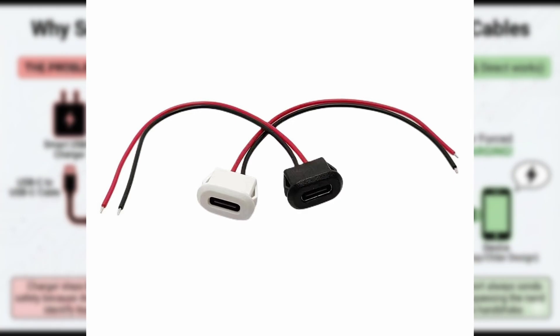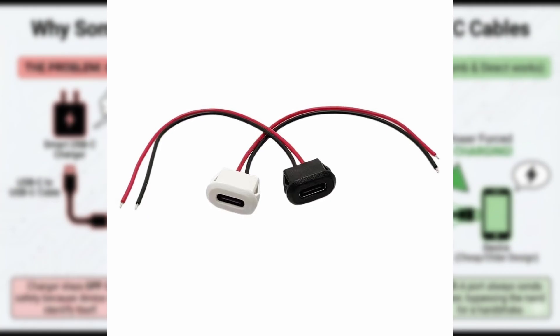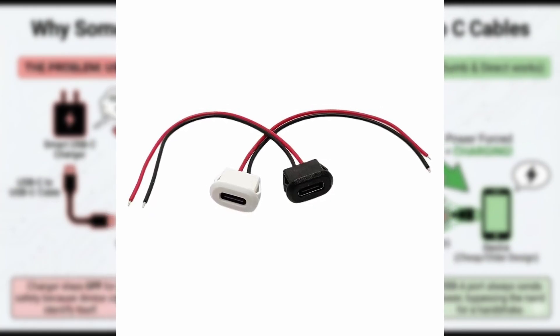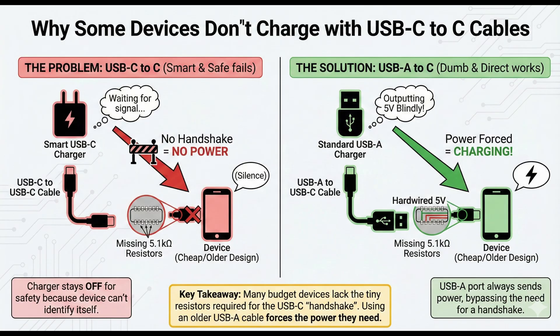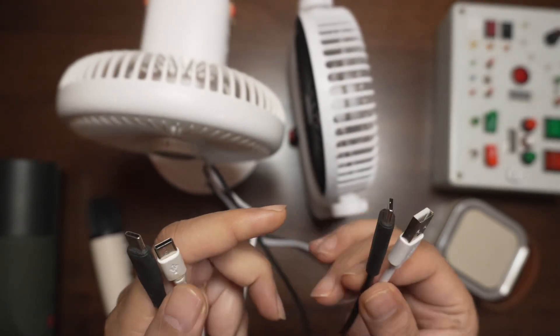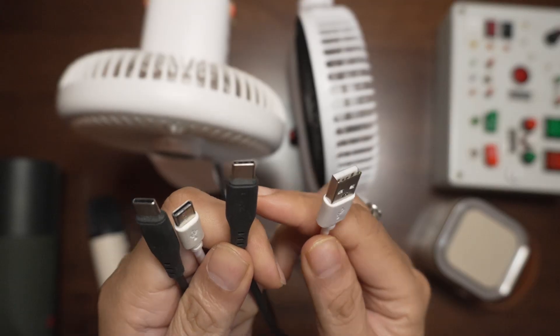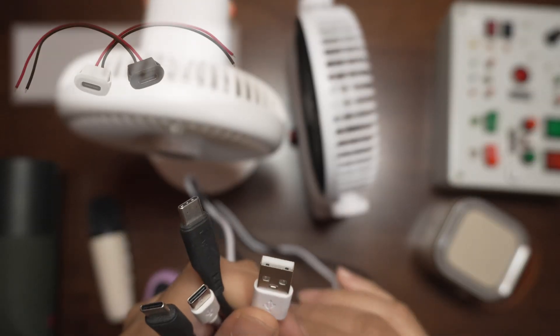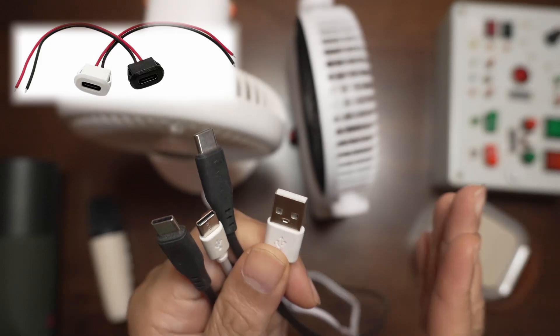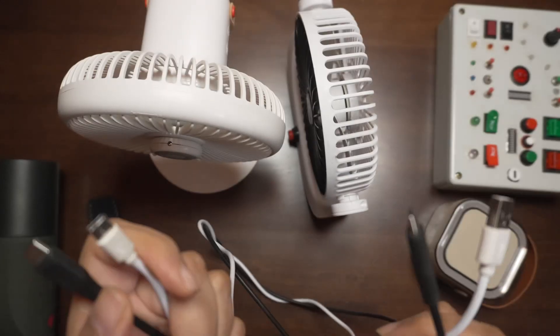It's most likely that the ports on these cheaper devices have a USB Type-C port, but the output at the back of these ports are just two wires to drive in 5 volts. It's not going to charge because the Type-C cable will not transmit power without a handshake. So next time, if you have a cheaper device, it's most likely not going to charge with a Type-C to Type-C cable. You'll have to use a Type-A to Type-C cable because there's a little bit of circuitry required that's missing in cheaper devices.